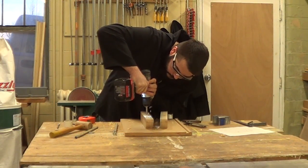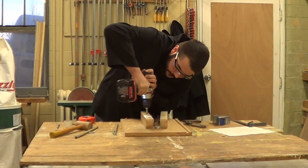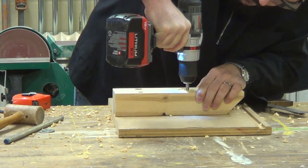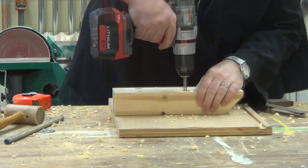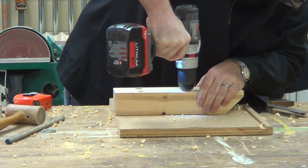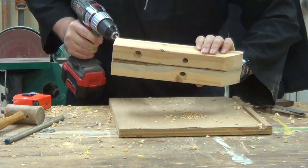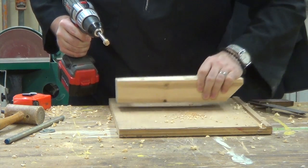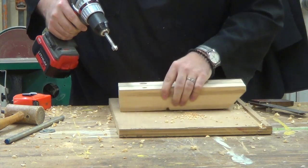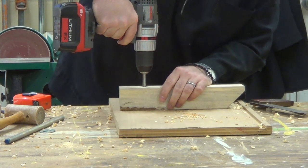I'm repeating the process of drilling with the thicker bit first, though this time I'm using a 7/8-inch drill bit. The purpose for the larger bit is that we now want the bolts to be able to freely turn inside as part of our screw mechanism. I'm also drilling down twice the depth for those bolts because we're putting two of them together to lock them. Then I'm going back again with the half-inch bit all the way through, with a piece of scrap wood underneath so that when it breaks through on the other side you have a much cleaner cut. This is done for both jaws.